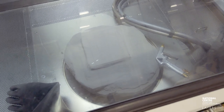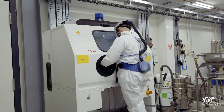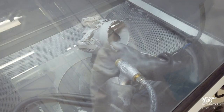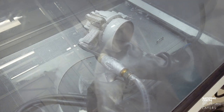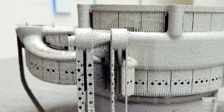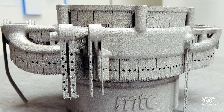That's the actual semi-sintered powder cake. The cool thing about this is it's using compressed air and the titanium powder from the same build to provide that abrasive action to remove the powder cake and expose the parts. And there you see them for the first time. The process takes anywhere between half an hour to an hour depending on how many parts you have in the build.